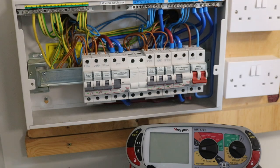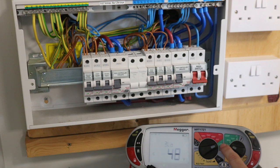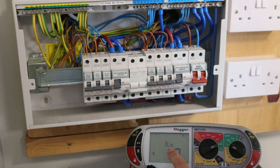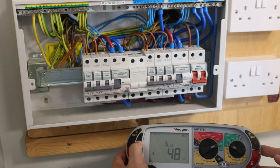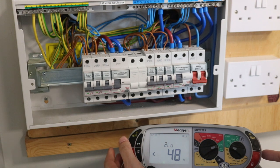Our prospective fault current test. For this machine, we turn our left hand dial round to the first green, and the right hand dial we also have on the first green. You will see it says 3 low — we need to push this arrow button until that changes to 2 low. So 2 high, and now it says 2 low.